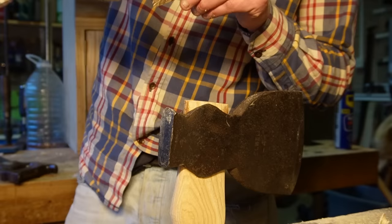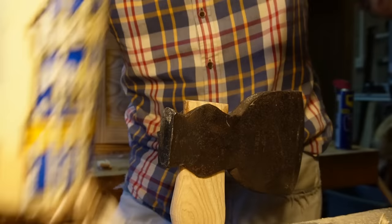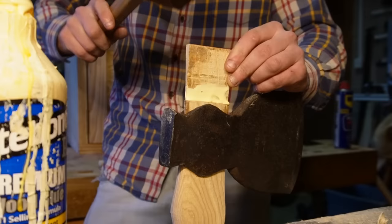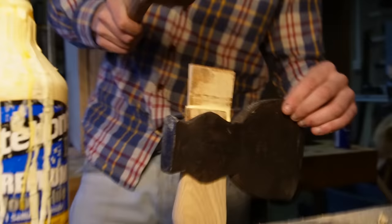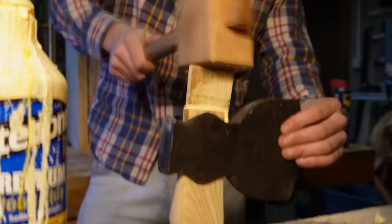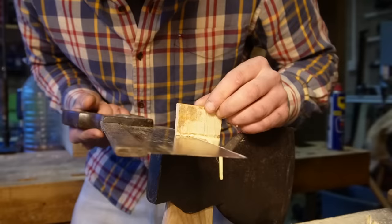So with that all on, I have an old ash wedge here and I'm just getting a bit of glue onto it. Once we have that on, I'll just slot it here into the wedge where it belongs, and just tap it into place. Then once we have it locked in, we can give more firm blows just to really make sure it doesn't go anywhere on us. I don't think that's going to go any further, so I'm going to come along with the saw then and cut off what we haven't used.